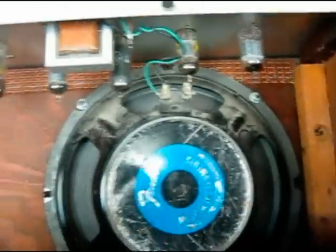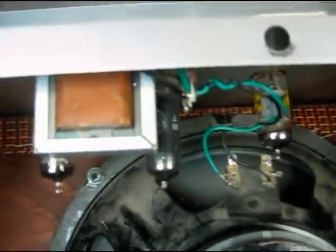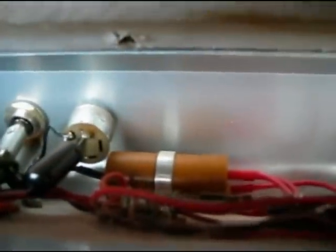I want to give you guys the first clue as to why Gibson amps never get anywhere near as much love as Fender amps. I finally figured out how to get inside the chassis — believe it or not you have to remove the back panel. Two bolts come from the inside which you have to locate before unbolting. Then to remove the chassis you have to disassemble the box and remove the speaker baffle, which means removing four bolts and unsoldering the speaker lines. If you're a service technician you've already spent three quarters of your time just getting into the box. There's a rubber stamp here — this amp was built in 1963 and looks like it really hasn't been serviced since. There's the original filter cap, point-to-point wired the old-fashioned way with everything on flying leads.